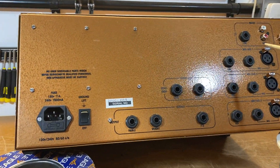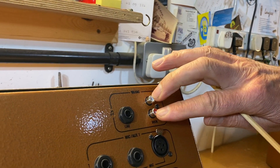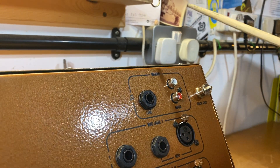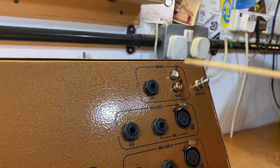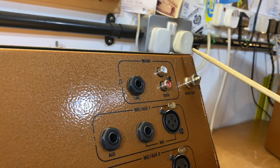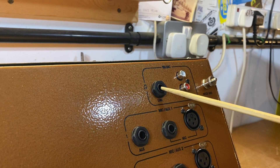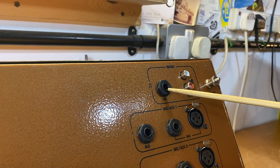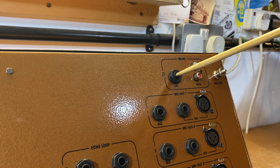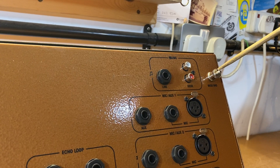If you're just using the deck without the phono stage preamp, you just put your deck in there — stereo left and right — it's blended inside the preamp and turned to mono, because everything's mono on this system. You put your deck in there and put the switch on the front of the preamp to deck position, and then you've got a gain for the deck. Alternatively you can put in a mono line in — which is from the Valvetron phono stage, which converts stereo to mono — and comes in on a line in here mono. Or any other line level input: CD, phone, laptop. And you've got the full music channel to play with. This is a ground for your deck, for your earth clip.